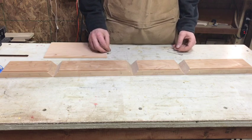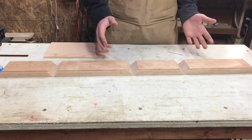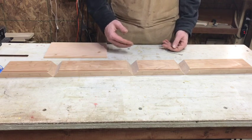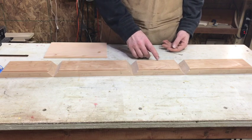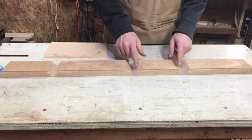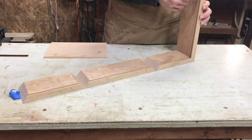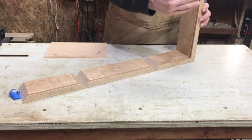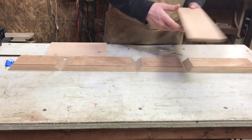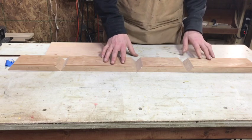I'm personally a little obsessed with having the front lip of my box almost disappear — I want as thin a line as possible so you almost can't tell where the lid lip is. To do this I often use gravity to my advantage. The reason we want either a cup or a flat board is when we cut this groove, the lid will ride on these two outside edges as it's coming out, and we want it touching the bottom of the front so that gravity keeps it down. That allows for a slight ride-up so gravity locks the lid down itself.